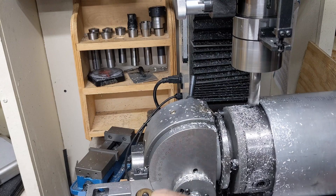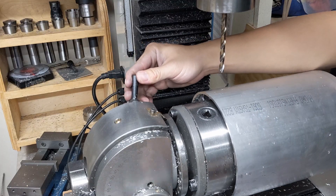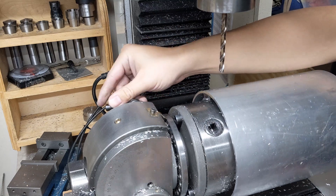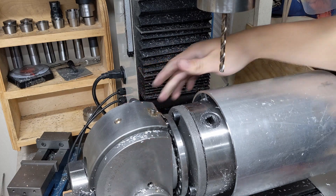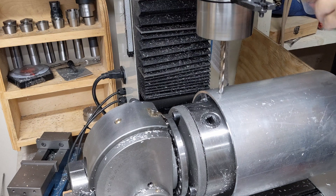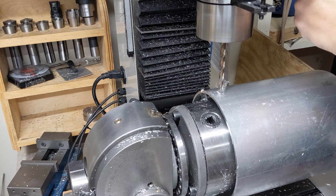When you're done you now have your reference point for when you need to drill holes. Because I did this on a dividing head I was able to go straight into drilling the holes in a neat eight-hole pattern right away. For those interested in designing rockets, it may be worth knowing the limits and capabilities of your machines. This dividing head has holes for 15 degrees that lock in place, so you usually want to make your hole pattern some factor of that, like eight or twelve.